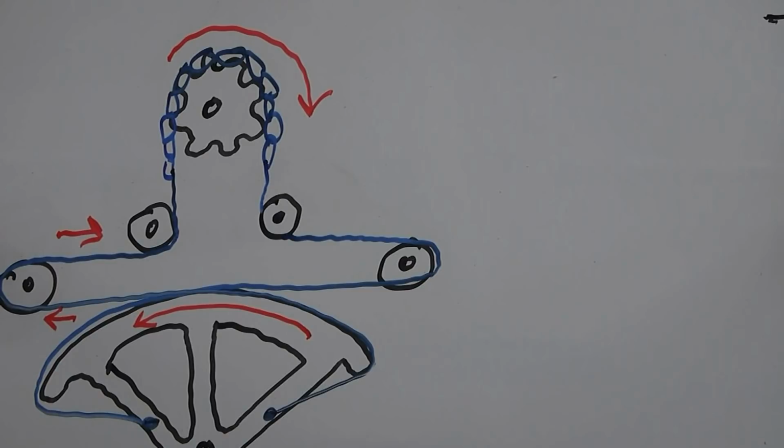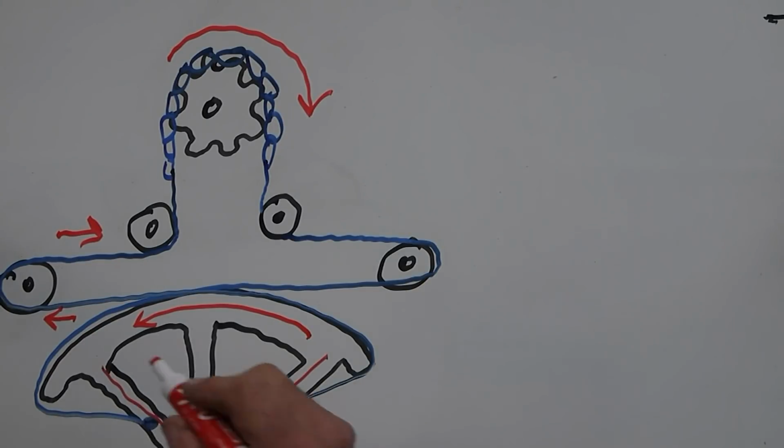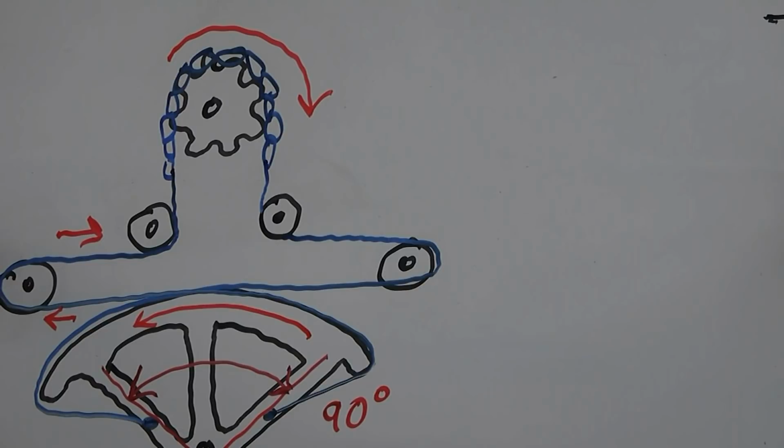Okay, I have to think about the steering geometry a little bit. In other words, how many turns lock to turn the rudder from hard left to hard right. And that's calculated by the total turn of the quadrant. So the rudder wants to turn about 45 degrees in each direction. In other words, lock to lock would be 90 degrees. And we know that the quadrant has a radius of 10 inches. So let's do a little trigonometry.